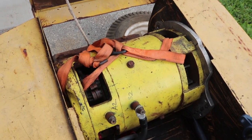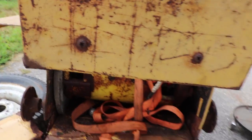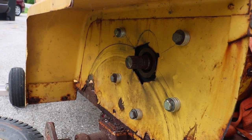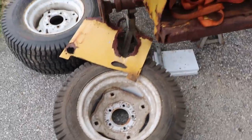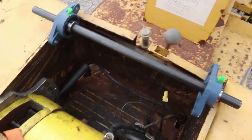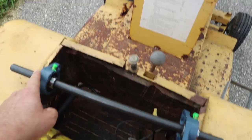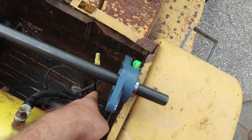I've got the motor in at least temporarily. The back of the tractor was so rusty I simply cut that off, which made it easier to get the motor in. But the motor is so big the drive shaft actually sticks right out through the side. So my plan is to run a chain on the outside of the tractor. I can spin the tires around backwards so they're further away from the body. And then back inside the box I'm planning on having a jack shaft — I'll put a sprocket on this side which will be out under the fender, transferring power through down to here where I'll have a sprocket and a chain going down through the box.